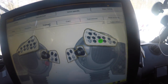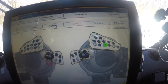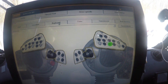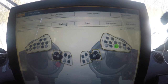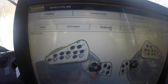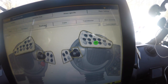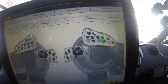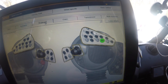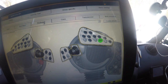My third button on my right hand is a restore button. If you let a log go and your saw is not set at zero at the end of the wood you're cutting, instead of running the saw to reset the counter, I press this restore button and it sets the saw counter back to zero for a new cut. I also have multi-stem harvesting — I don't use it too often, I just have a checkbox set for it, and going into manual mode kind of eliminates it anyway.